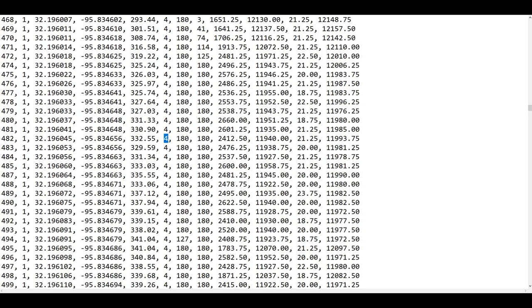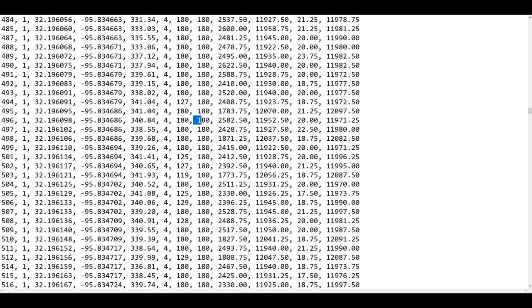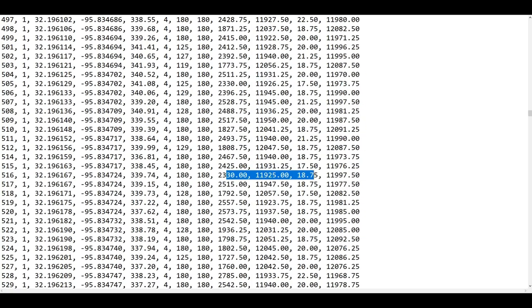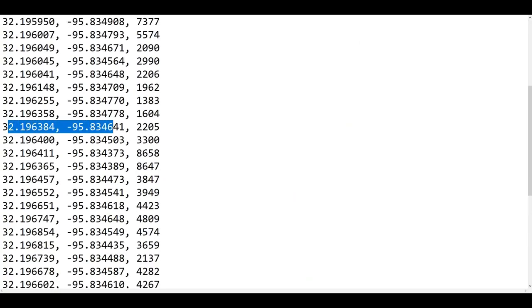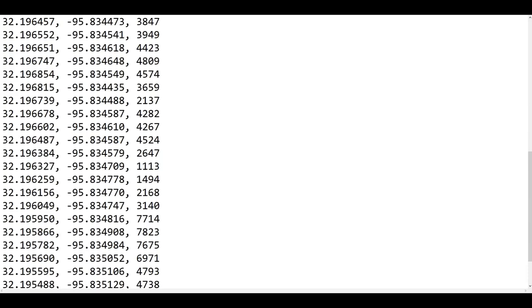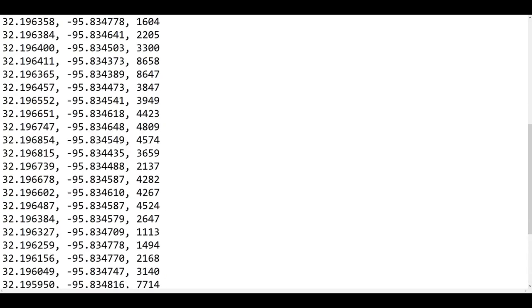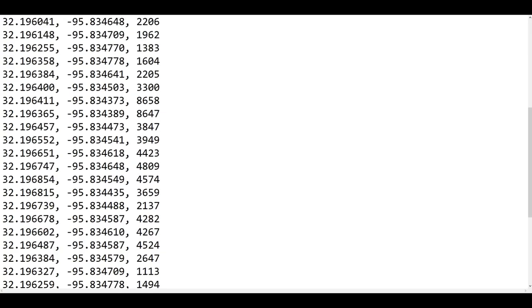That's the current waypoint it's trying to get to. The throttle of both motors, left and right, shows when it dips and when it's increased, and then current and voltage measurements from both of the power sensors. It also outputs a similar file dedicated only to GPS coordinates and depth measurements. This one's at a much lower sampling rate of about once per 30 seconds, just so that I don't overwhelm my plotting code with a ridiculous amount of points.